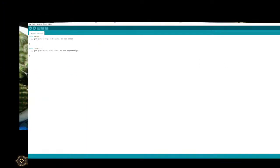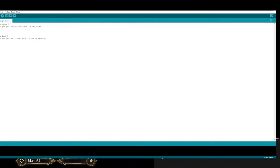Alright, so we're gonna largen this up so you can kind of see here. So this is Arduino. It shows you basic codes, all that jazz. What it's gonna do is when you go to Tools, you're gonna want to select here your board that you've bought. Sometimes yours is not listed. That's totally fine. You can search on Google like, hey, the Metro Mini, what do I put? In case it's not listed, and it'll tell you, hey, you'll select this one instead.